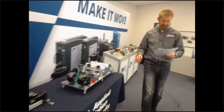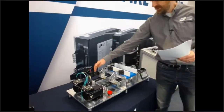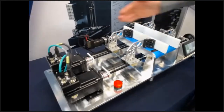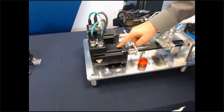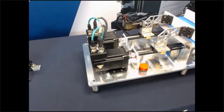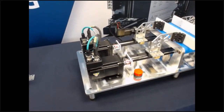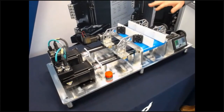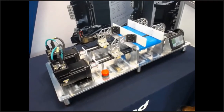Here's my favorite demo. As it's running right now, you can imagine these are setup axes on a conveyor system. We have a TSM-17X step-servo integrated motor with a 5-to-1 gearhead running the conveyor belt itself. We have a TXM-34 step-servo integrated motor with an incremental encoder running this back axis. We've got a TXM-34 integrated motor with the TrueCount absolute encoder running on this front axis. Both are running Q programs cycling between a few different positions as positioning moves. In the real world you wouldn't be moving these setup axes this fast — maybe we call these diverter axes with an optical system directing traffic on the belt upstream. The point is, we have two motors here doing the same thing.